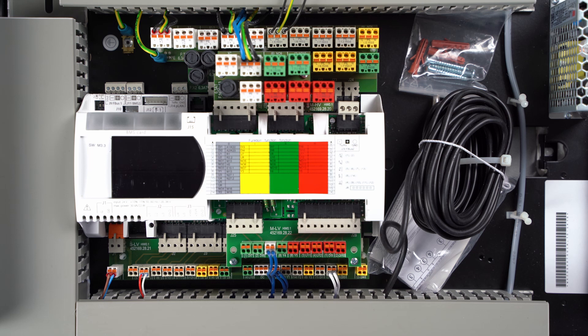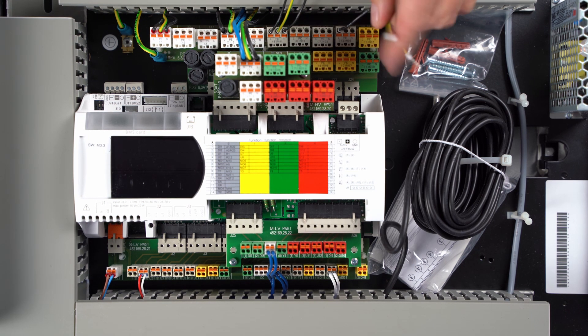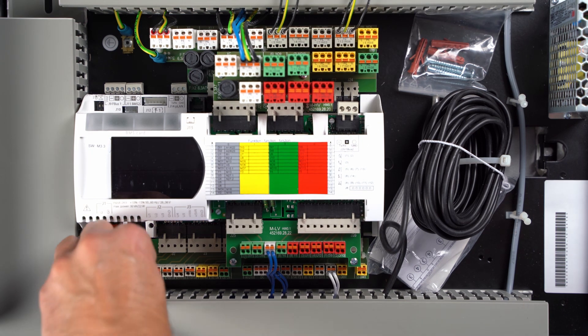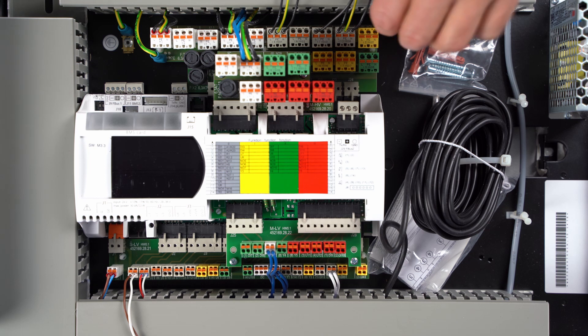This procedure is to be carried out in the same way for all other inputs and outputs. The circulation pump M16 is clamped onto the gray connector 13, N04. The outside temperature sensor R1 is clamped to the gray connector 3, U2. And the relay K20 for the immersion heater or the pipe heater is clamped on the gray connector 7, N03.